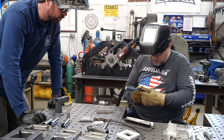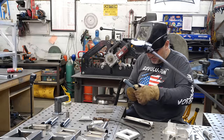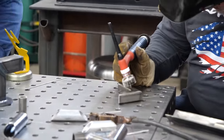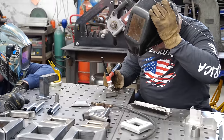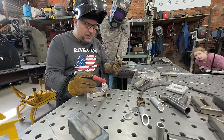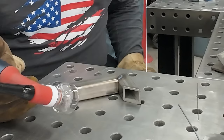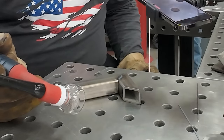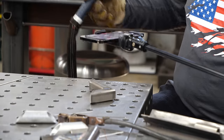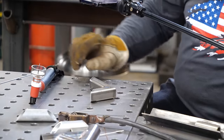I want to keep this more golden-ish. Get the flow bumped up to 50, then I'm going to set my post flow to 50. I like the lower frequency to be a little bit lower. Give me on the pedal 150, 160. I pulled the filler rod out too quick when I was lifting the helmet. Better-ish — I still don't like it. So you're using the stainless here to pay attention to your heat control so that when we transfer over to titanium you're ready.